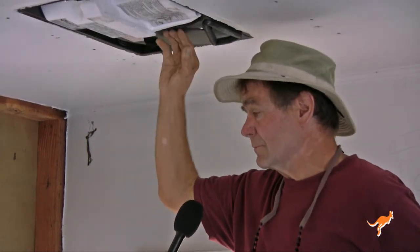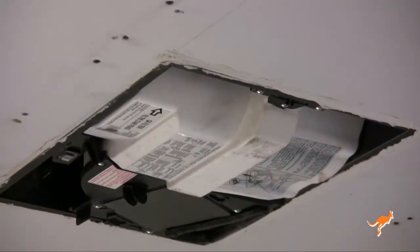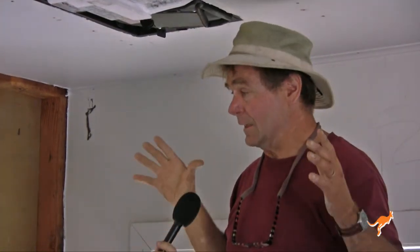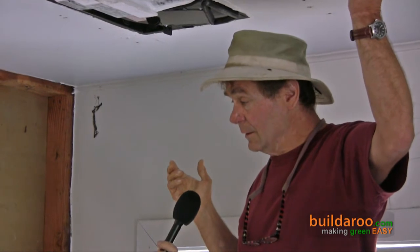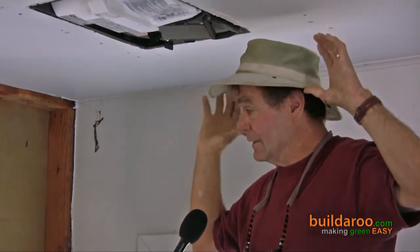It's not the best suited for this climate — we don't need to recapture moisture, but this is all I could get. It's a miniature heat recovery unit, and what it does is, because we made the house so tight and airtight, you get into the problem of needing to get outside air in. The ASHRAE standard is that if you get a house below 0.35 air exchanges per hour, you have to bring in mechanical air. Traditionally, if the house got too tight, you'd put in a bathroom fan and run it, which would take any air in the house and just blow it outside.